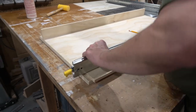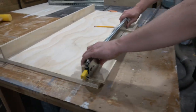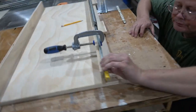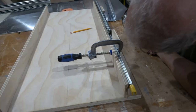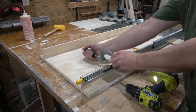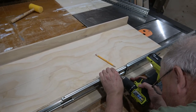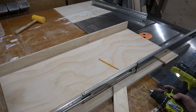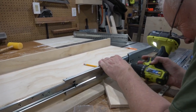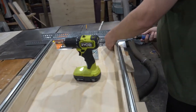Now that we had the entire tray — the wood parts anyway — assembled, we turned our attention to attaching the glides. We used a couple of pieces of half-inch offcuts to raise it up a half inch off the bottom of the deck to orient the glide correctly, and once we were satisfied with the placement we started to attach it using some small five-eighths screws. The glides have holes that allow you to reach through and fasten to the substrate on the other side. It worked really well and it wasn't long before we had both glides attached to the wooden substrates.